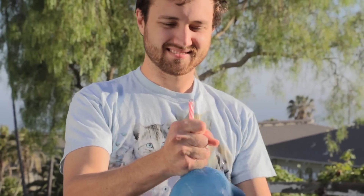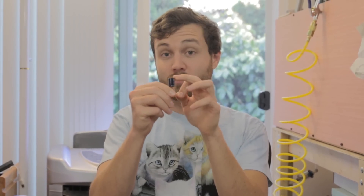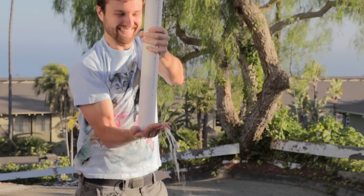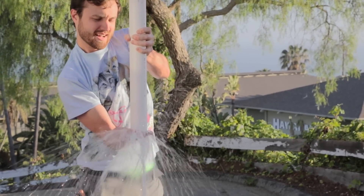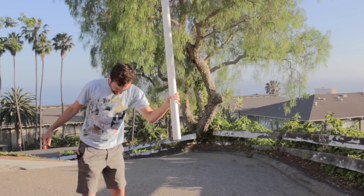A capacitor is an energy storage device, like a balloon swelling up with water that wants to squeeze the water back out. There are two types: a ceramic capacitor and an electrolytic capacitor. Electrolytic capacitors are bigger, but they do not like being charged up backwards — so they're exploding because they're being charged up backwards, which allows current to flow, they get hot, and basically like a little steam engine, they blow up. A resistor is more like a pipe with water flowing through it with a restriction inside that limits current flow. These get hot and explode depending on how much power is being lost across the resistor — too much heat and they blow up.